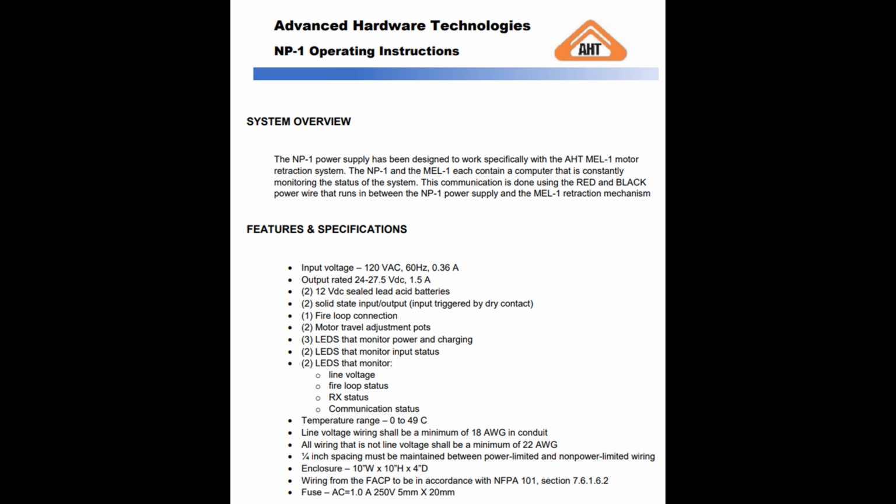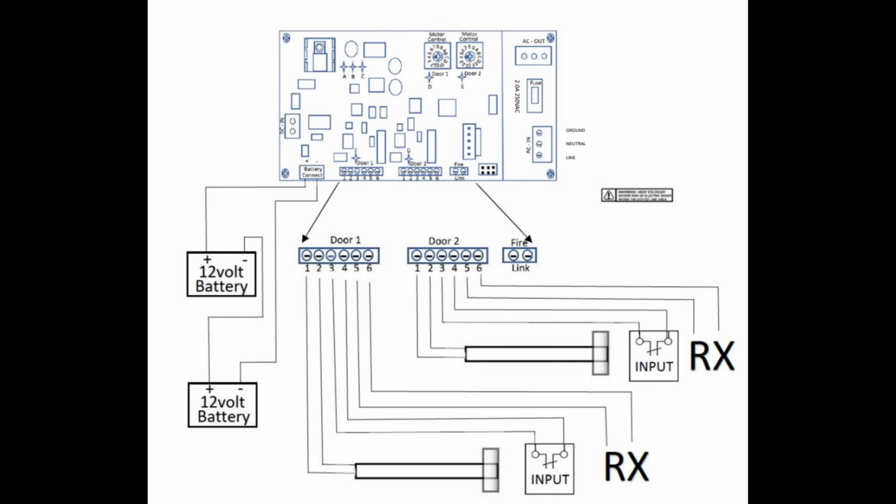Okay. So right now I have it on DC amps, and it's bouncing from 3.9 to 4, and that's more than what I should have, right? Well, it couldn't be 3.9 or 4 amps because the power supply is not producing more than 1.5 amps. So I'm thinking it's 0.39 amp, rather than 3.9 amp. So 400 milliamps.